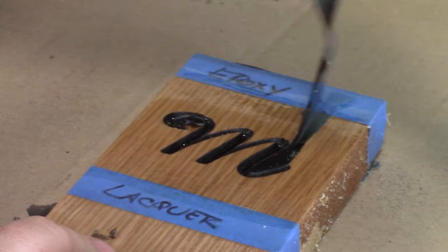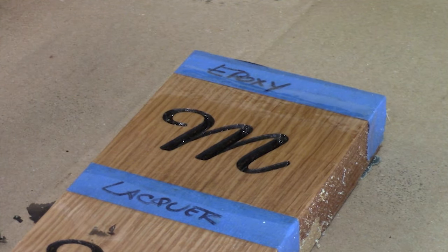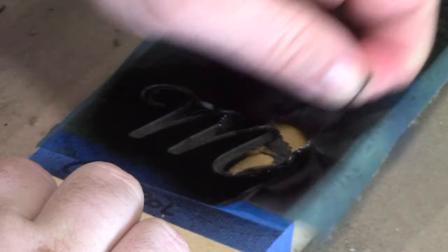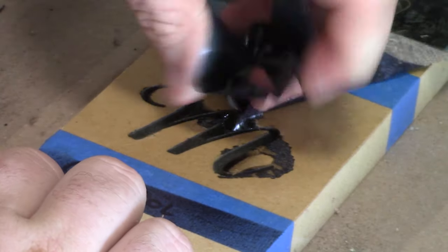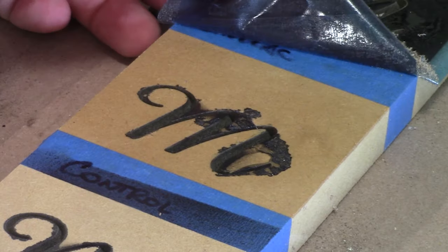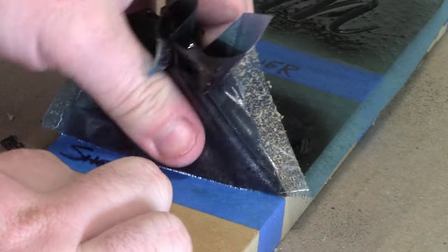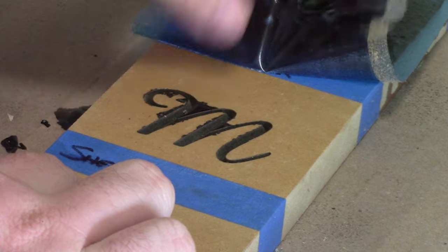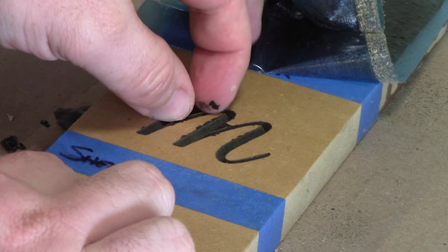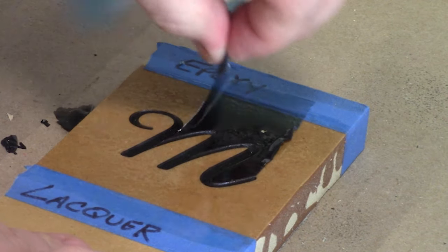Now let's move on to the epoxy — just like I thought, it would be clean and beautiful. And then finally, let's move on to the MDF. With the shellac, the MDF left quite a bit of bleed right there. Now, again, that could still be on top of the shellac, so if I sand it off it could come up. You get a similar result with the lacquer, and this could be because the edges crept up a little bit and didn't stick to the material — so that could be my fault. And then with the epoxy, we actually get a really cool finish on the MDF board. This may be my go-to when I'm seal coating MDF.